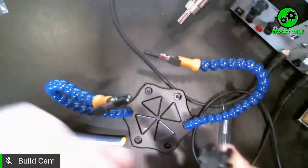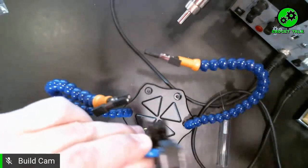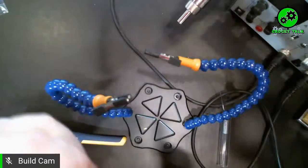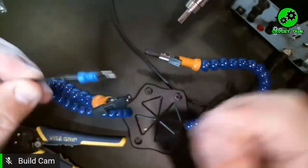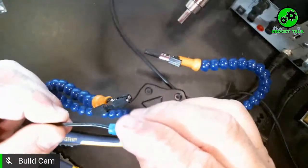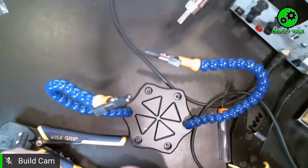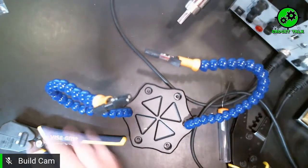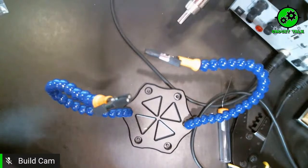But now that you have this, we'll just show it this way here real quick. Now that's solid, and that's not going to go anywhere on there. So it's much better than crimping to some stranded wire. Right. Now the other one that we keep talking about is on the LEDs, about tinning those tips because they're so thin.